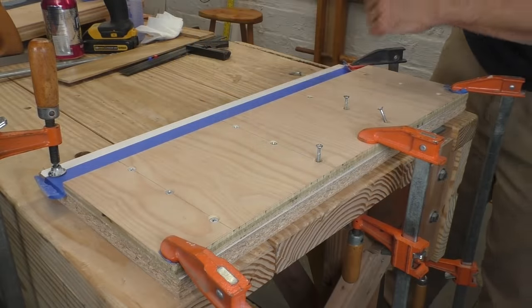Once it's assembled, there's no need to wait for the glue to dry. The fasteners will keep everything together, and I can add a cleat to the underside where it will register against the edge of my bench and resist the pushing force of the plane. People often get confused about how a shooting board can work. They think you've got a plane riding back and forth on this track with the blade sticking out, so of course the plane blade must always be chewing away at the plywood and eventually ruin the shooting board. Well, it doesn't actually work like that. If you look at any of your bench planes carefully, you'll see that the blade extends most of the way across the sole, but there's a little lip where the blade doesn't cover, so this part can't cut into your jig. The plane will cut, but only for the first few strokes. Then the sole comes into contact with the wood, and it stops cutting.